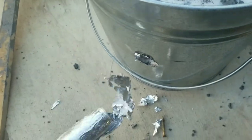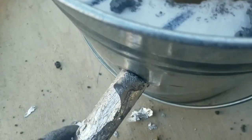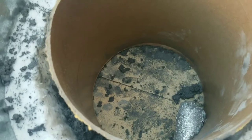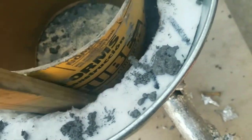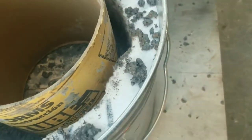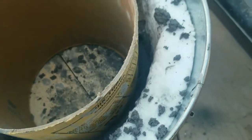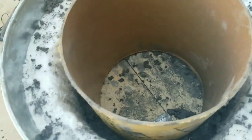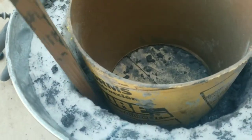You want to get it down below that surface, and then I'll push this pipe through. I'm going to just push this through and force it through there. I have that in there going in at the angle I needed it at, with a pretty good equidistant spacing. I'm going to keep packing this down and now it'll start going over the pipe. As you're disturbing this mixture, it's bringing all the moisture out and making it soupier because of the vibrations. You can even take something that makes a lot of vibration, like a sander, and put it on the side — it'll keep packing and making all the bubbles rise to the top.